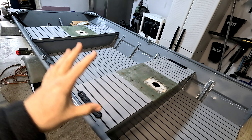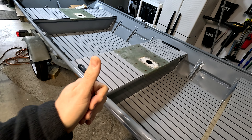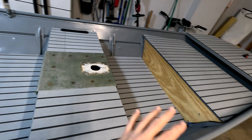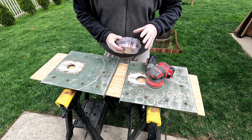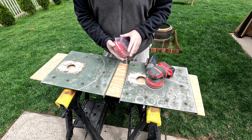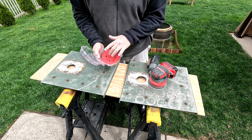To get started, I'm going to pull these plates out of the boat and the first thing I need to do is get them sanded down. That'll get rid of any of the rust and corrosion and get the surfaces ready for paint. Once I get the plates here prepped, I'm also going to be pulling off the front face to this hatch here and get that painted as well. I'm just going to be using my sander with 80 grit Diablo sandpaper. I've used one pack for literally two and a half boats — I'll throw a link in the description. These have lasted me forever. I just use them until they get slightly dull and then throw on a new one.